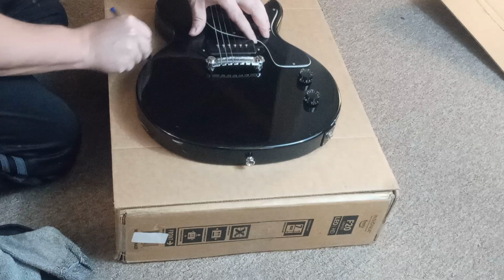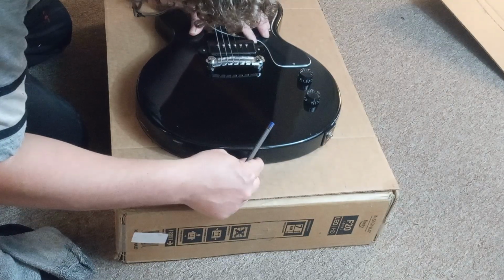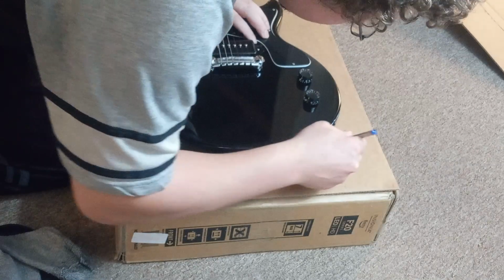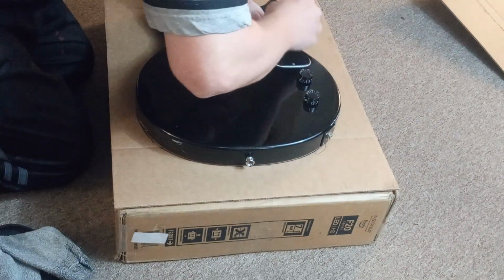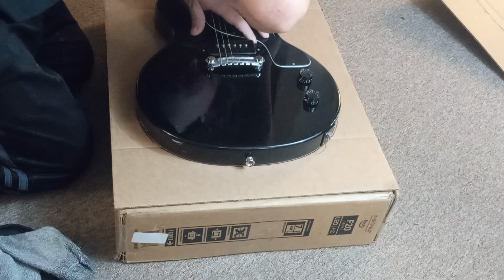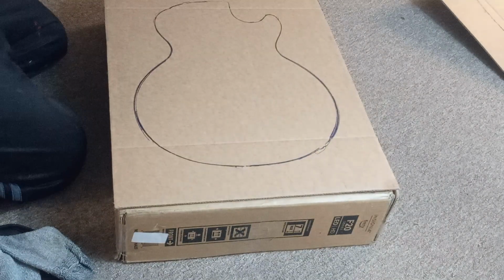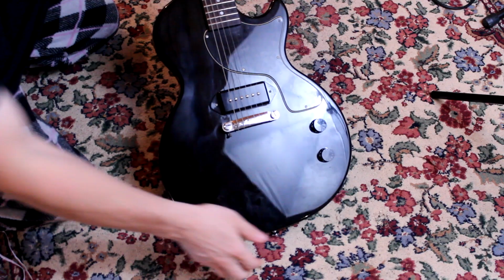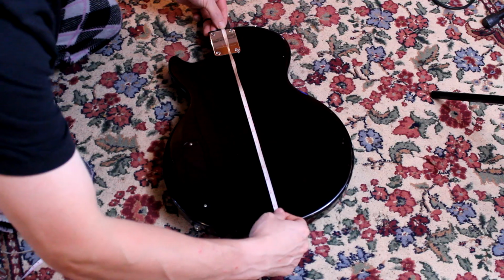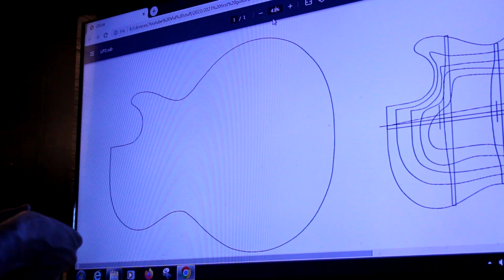So, if you do decide to set out the arduous task of building your own templates completely from scratch for free using garbage, the most obvious, common sense, and direct approach to copying a guitar body shape may seem to be lay the guitar body down and trace it. But against common sense, this may prove to be wildly inaccurate due to the edge of the guitar being radius. As well, you may not have an example of the guitar you wish to copy. So if you have the basic dimensions of the body, and you can usually find these online, you can also find a PDF of a clear outline of the body or even a picture of a rare guitar online.